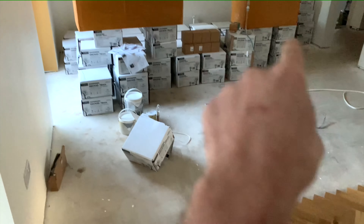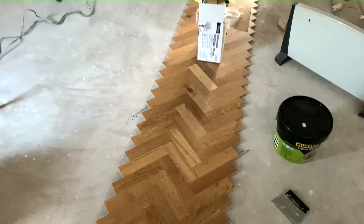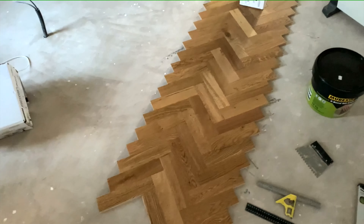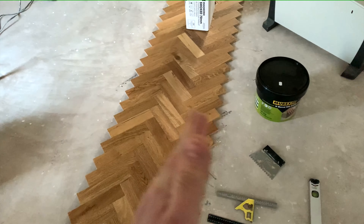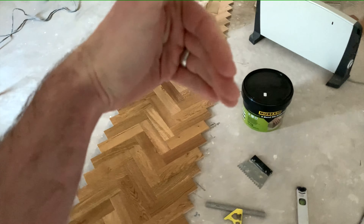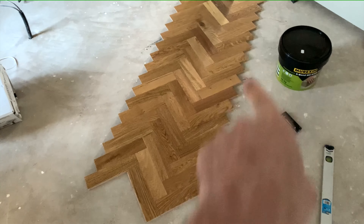I'm not going to go that way because we've got the kitchen island and the kitchen there. I'm just going to bring it across from here and work my way across that room. All the boxes are in here so it'll be good to start clearing them out. Just a couple of things in terms of pattern - this is the engineered parquet that we've gone for. It's got one tongued edge rather than two as we had in other floors, which means you don't have left and right, there's just one piece - which makes it a lot easier and less waste. With gluing it down as well, I found it just as strong with just the one tongue. In terms of pattern, I've done three at one time here, but normally I'd do two, and then you decide which way to go next. The next one will come in diagonally - you put the piece there first and then work that way, as putting a piece the other way restricts how easy it is to push the next piece in.